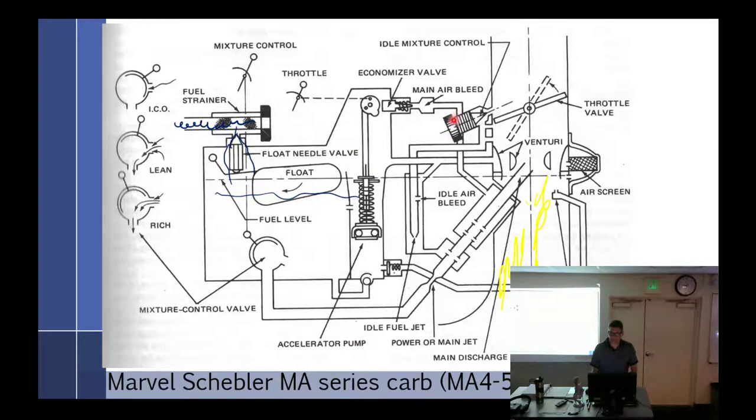What's in this passage right here? Fuel with a little bit of bubbles — that's metered fuel. We've got an idle mixture control screw: screw it in, it gets leaner; screw it out, richer. So that's pretty easy. That's it for the idle circuit.